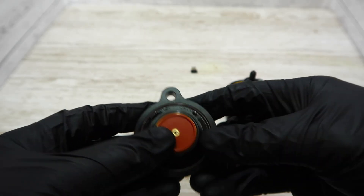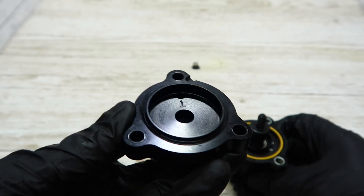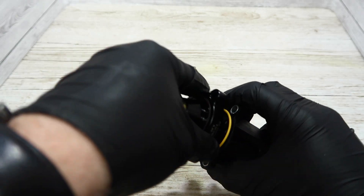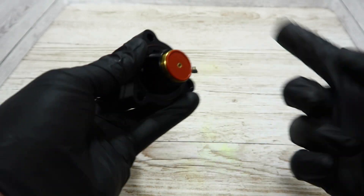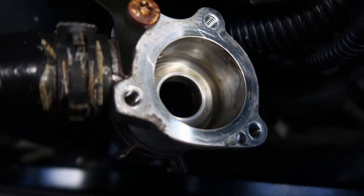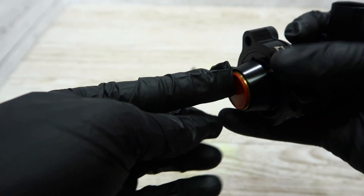So there you have it. If you haven't seen these being fitted to the car before in detail, check out my other video from last year - I'll leave a link below in the description. And just make sure when you're putting these back together, there is a small recess here in the top corner and that just lines up with the bit that sticks up here. It's perfect, it's got no issue at all - I'm really happy with that and it's going to go back on the car as is. Just remember when fitting these back on the car, the housing on the car itself will hold the piston in place once it's in place, but until then just make sure you always keep the piston in manually or else it will just slide out and you'll lose it in the engine bay.